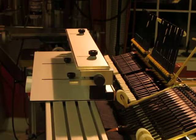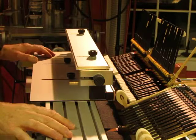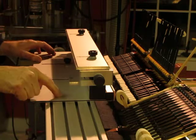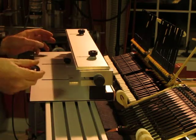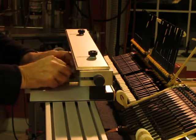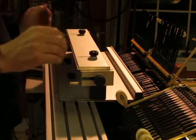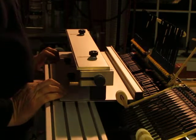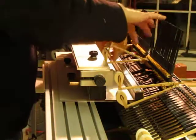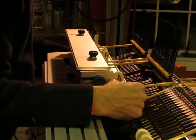I have installed the hammer hanging attachment on the sliding top of the squaring platform. The studs that hold the sliding top on act as the fasteners for the tabs of the hammer hanging attachment. I extend the sliding top of the squaring platform out underneath the hammers and bring it back so that the insides of the tails just touch.